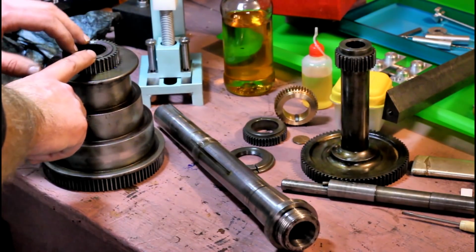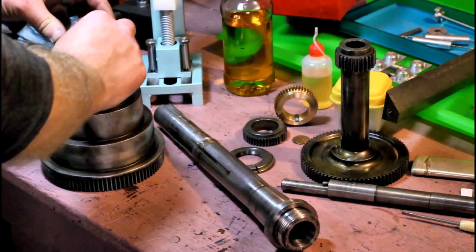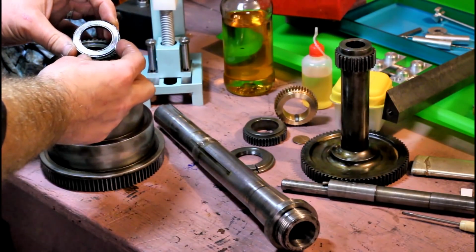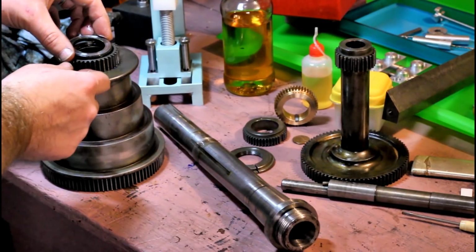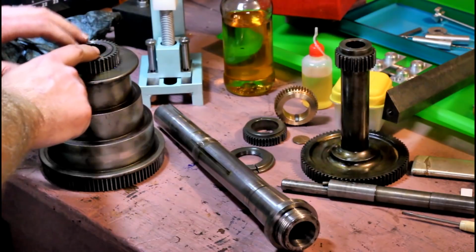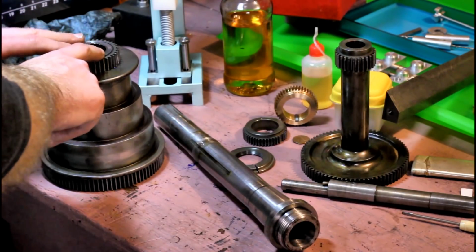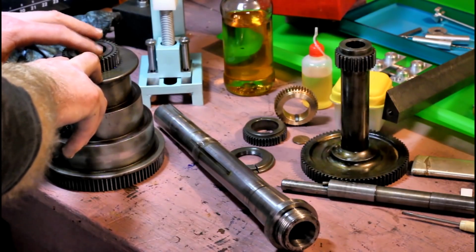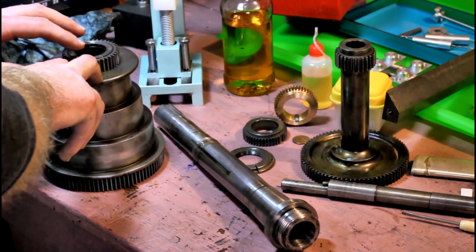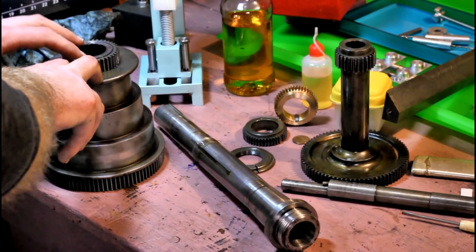At the front of the pulley assembly here is our thrust bearing, also in real nice shape. Be careful not to lose this and drop it when you're working with the pulley assembly. The suction from the film of oil can keep it held in place well enough that you might not realize that it's a separate part until it drops and hits the floor and shatters.